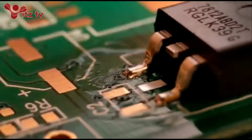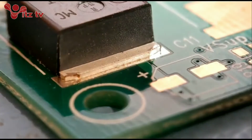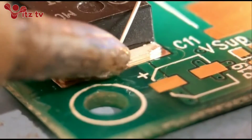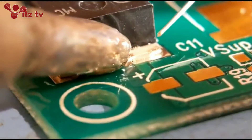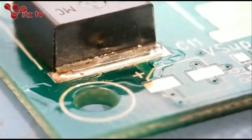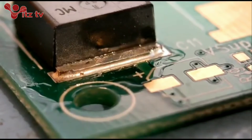So that's supposed to be your first end done. I'll just turn it round and solder up the other end. As you see, you don't get a lot of room on these components at the end - that's why if you pre-tin them, it really helps. Again a little bit of flux. When you get a ground plane on these components you might need quite a large tip - I've actually got a large tip with a flat side on it. Because it's already tinned, that's going to run really nicely underneath. As you can see, you've got a lovely joint right round the bottom, gone really well right along and spread underneath because it's already tinned. And that's basically what you're looking for in your regulators - if you're struggling with heat, pre-tin it and that'll really aid you.